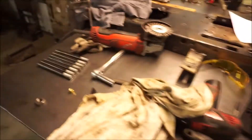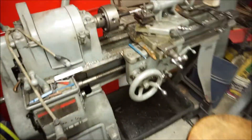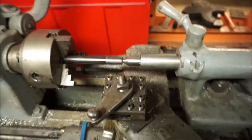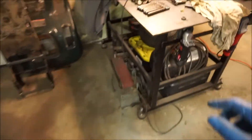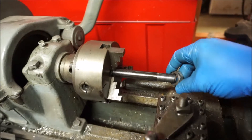We're back with part three, getting into the front end today. The shop's still a mess. I'm making my spindles first — I've got seven of them threaded here, doing single point threading on my old 1930s South Bend. Let's do it live on camera, see how this piece came out. Once you get into the process it goes pretty well.